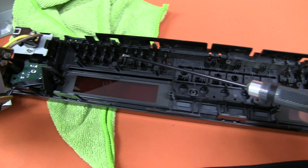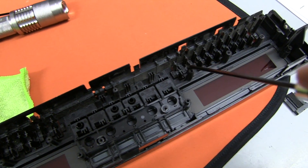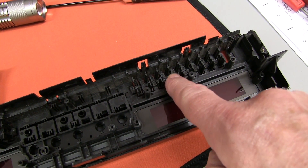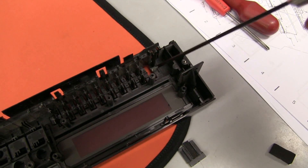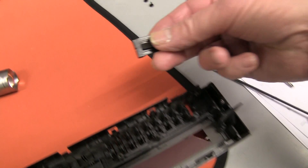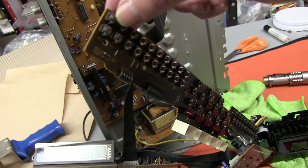Here's the problem — here are all the actuating plastic parts. These are all made in one big strip on some sort of machine, and then the center parts are glued or plastic-welded to the front panel. The little joining plastic pieces are what give it flexibility. If someone kicks it with their foot, this one broke off — and not only did the whole thing break off, the little end part has fallen off as well. The actuating knobs pivot and press these little button switches — a whole row of them.